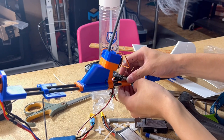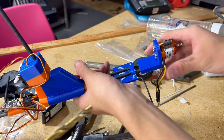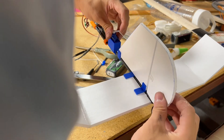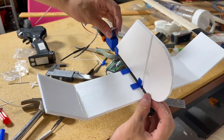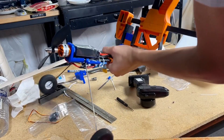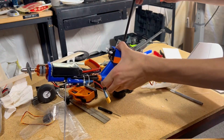The receiver was glued onto one of the 3D printed brackets, followed by the servo block holder and the motor mount. I got a bit lazy with the tailwheel and just glued it directly to the rudder, but this isn't ideal because it causes drifting in turns and is quite weak since all the weight is supported by the foam. I also yanked off the servo holder and shifted its position because I realized the rotor was placed too far back on the gyrocopter.